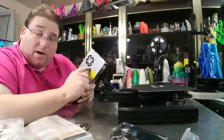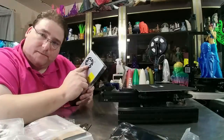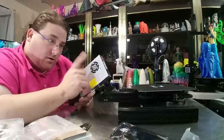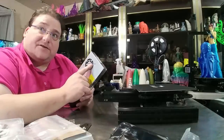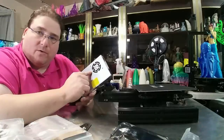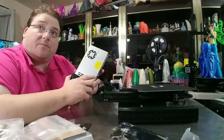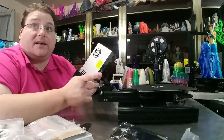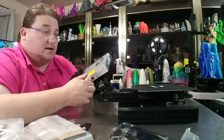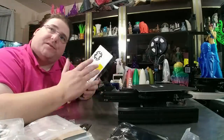If you want to upgrade this printer to a quiet fan, the Meanwell power supplies have pretty noisy fans. This fan is 12 volts — the board is 24 volts but it down-converts to 12 volts for the fan. The advantage of that is you can just replace the fan. Get yourself a 60mm by 10mm Noctua or noise blocker fan and you can drop that right in. Also, if you're going to install these in a school environment, you'll probably want the Ender 3 Pro because these are UL and FCC approved, while the stock power supply is not — so in a school environment you might actually be forbidden from using those printers.